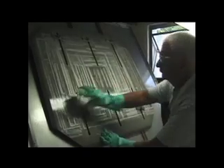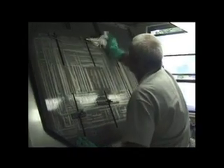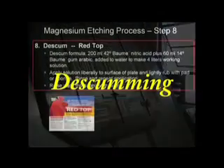Clamps should be wiped clean prior to etching. Cleaning the clamps eliminates any dripping of oil onto the mounted plate. This can lead to pimpling and areas of the plate that could completely blank out and not etch at all.